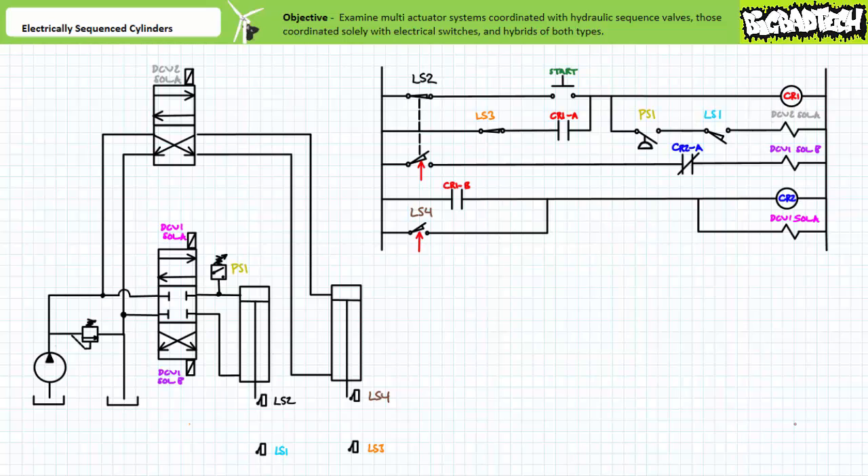The primary hydraulic circuit includes the solenoid-actuated three-position directional control valve DCV1, which directly controls the double-acting clamp cylinder. Additionally, it includes the solenoid-actuated two-position directional control valve DCV2, which directly controls the double-acting bend cylinder. Note also the presence of a pressure switch PS1 on the cap end of the clamp cylinder. When pressure on the input port of the pressure switch rises to the adjustable set value, the associated electrical contacts change to their activated opposite states. When pressure falls to the slightly smaller reset value, the associated electrical contacts return to their deactivated state. The differential between set and reset pressure values is desirable in that it prevents switch chatter when pressure hovers near the set value or experiences minor pressure drops.